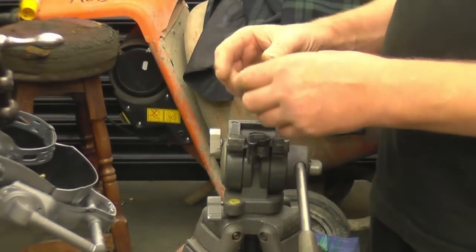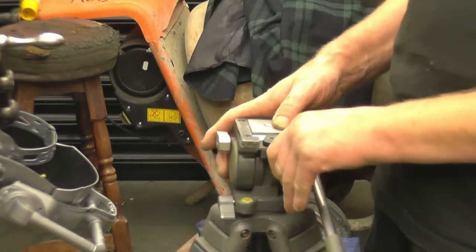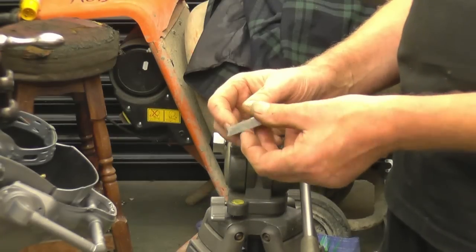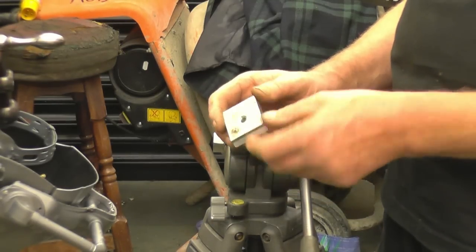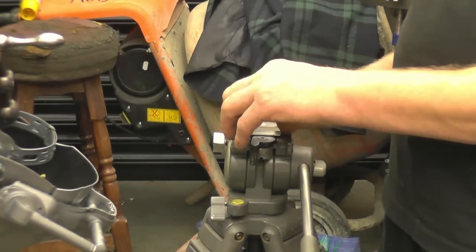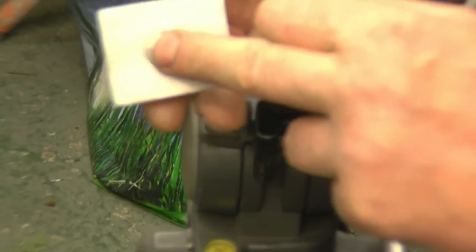It's got a quick release plate. That's actually a plate I made — it had a plastic one, I lost it, so I made an aluminium one, then I found the plastic one. Basically that goes in there and there's a little cam that locks into place, so you can take your camera in and out quite quickly. I've got no idea where the little bolt is that went through there — it's a quarter Whitworth bolt. Cameras are all quarter or 5/16 Whitworth for some strange reason, so I need to make a new little bolt. It's got a little slot in it so you can tighten it with your finger. I'll get a close-up to show how it works — that fastens onto your camera with that little bolt.